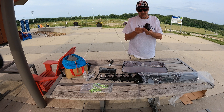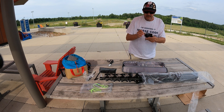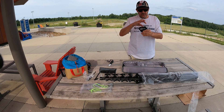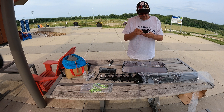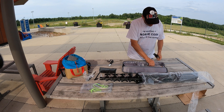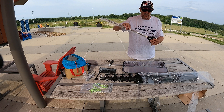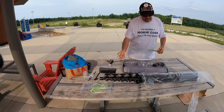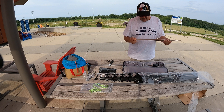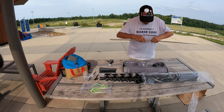Then we have the V-base — this is the key critical component. It fits into the mast assembly on the tripod, has a coax connector, and probably M10 metric thread — not 3/8-24, it's a different European metric thread count. This is where you connect the telescopic whip elements, which I believe are about 17 feet long. The innovation that Jesse at JNC Radio came up with is they have markings embedded on here — for example, here's 14 MHz.